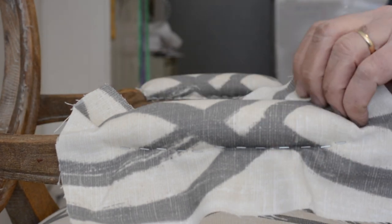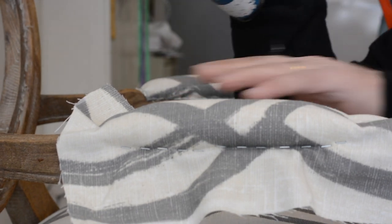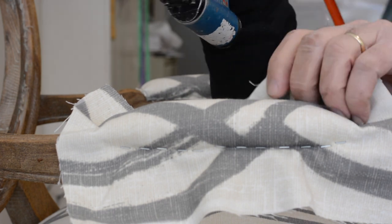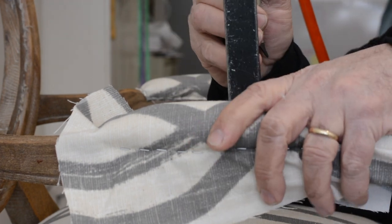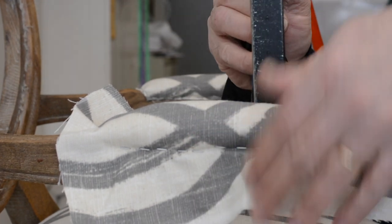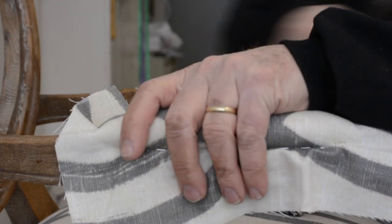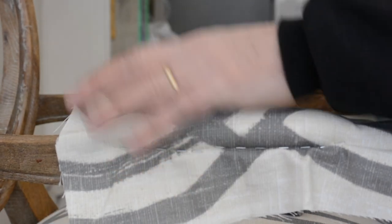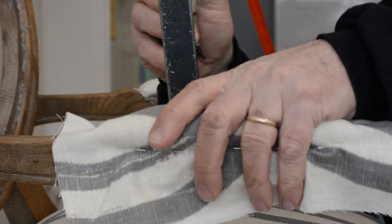It's a little bit longer process, but you have more control. I just undid the three pin tacks over here — undid the one on the left — and I'm going to stretch it now and start stapling that. Notice how I'm coming over, stretching from over there. Now I'm going to undo the last pin tack towards the back, stretch to the back, and then staple that all down.